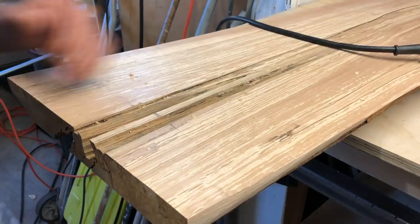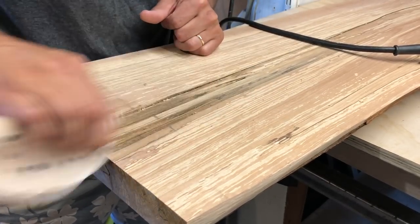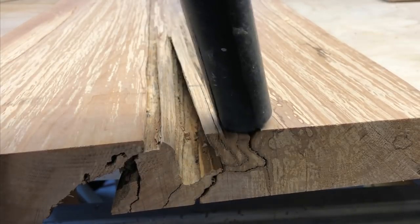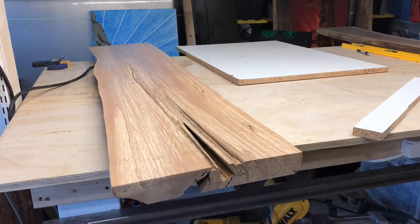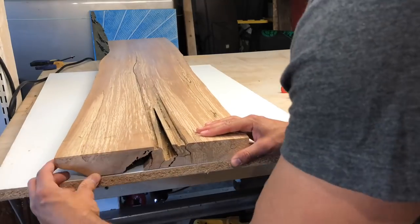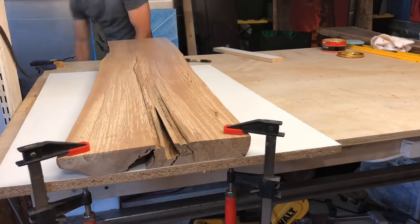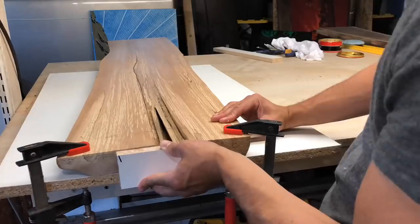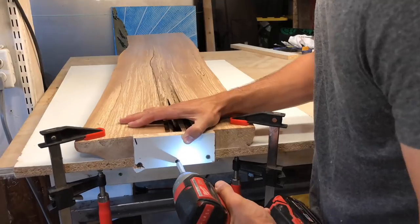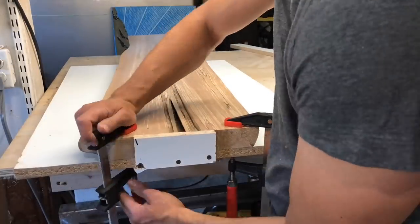The only reason I purchased this piece of wood is because it had a very unique groove on one side — a perfect candidate for epoxy resin wood casting, something I've been wanting to try. A small project like this was the best way to start. First, clean up the hole as best as possible. I'm taking some melamine paneling and putting car wax on top of it, spreading it out so there's no chance of the epoxy sticking. I then pin the board to the melamine panel and cut a small piece of melamine to block off the end of the board, guaranteeing no epoxy spills outward. I also fasten it and silicone the edges to ensure the epoxy won't escape.